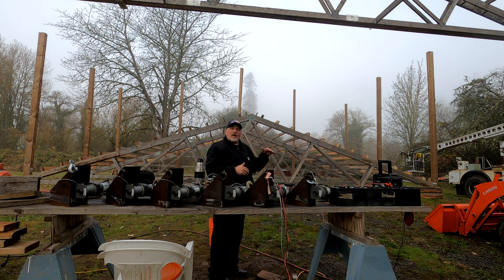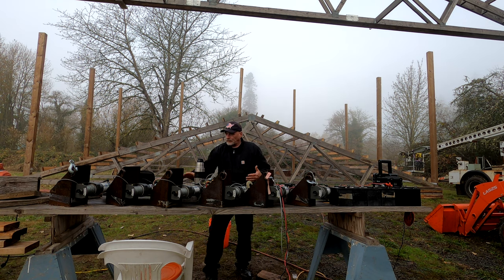That's also going to tell me where the truss is going to be sitting on the post. When it's twisted, your post is supposed to be like this, and it gets twisted like that, but your truss is coming in like this. So you have to cut corners. We're cutting the corners off of that twisted block so that the truss can go straight on there, if that makes sense. But I'll show you when I do it.